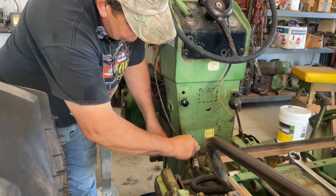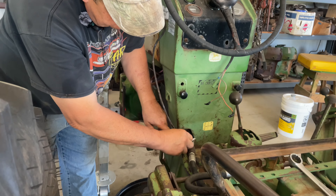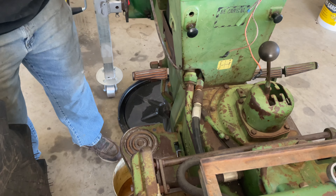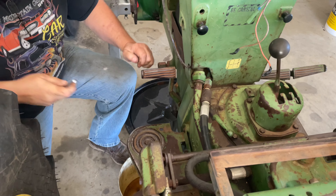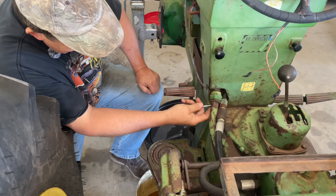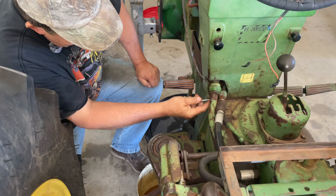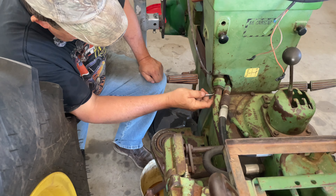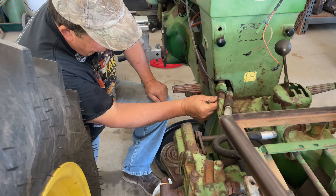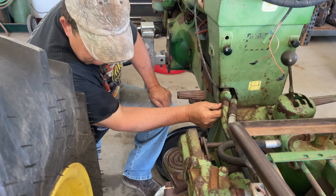I'm going to get these two bolts disconnected from this flange right here on this tube. Since there's really no pressure on this tube, it's actually suctioned - it's a cork ring type of fitting in there. Not the best type of sealing. I may try to do some V-ring type packing on this instead. I'll have to see what's available - I know McMaster Carr has some.